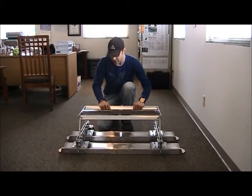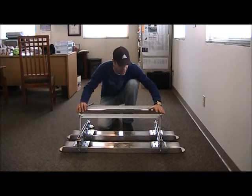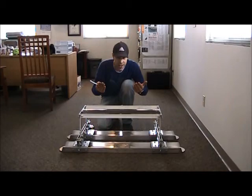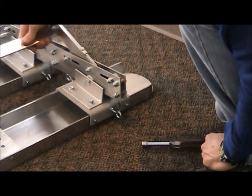Take your quarter by 20 nut driver and tighten all of these quarter-inch bolts — there's going to be four of them per base bracket. Go around and tighten all those evenly. Your base brackets of your mechanism are going to be joined together with your C-channel floats, allowing it to stay attached when it pivots forward and reverse, so those floats follow that mechanism and give you the right tilt in the right direction. They don't need to be real tight, just tight enough to bite into that C-channel so you know it's going to hang on when it goes to tilt.